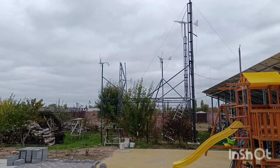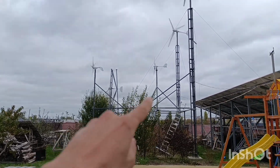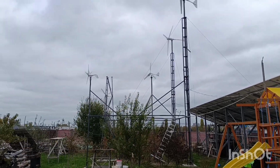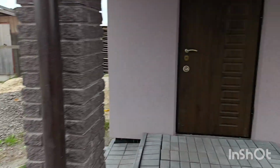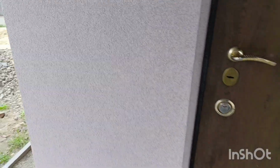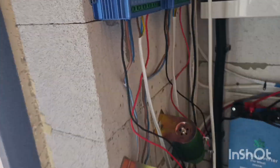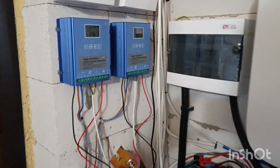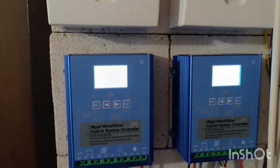Let me give you a short update, because that's kind of interesting. I remodeled all those three to actually work now in a 48 volt system, and they all go now not in 24, but in 48 volt. Why did I do this? Because I'm preparing to move everything to be unified and to have the lithium batteries, and there I have a 48 volt battery bank.